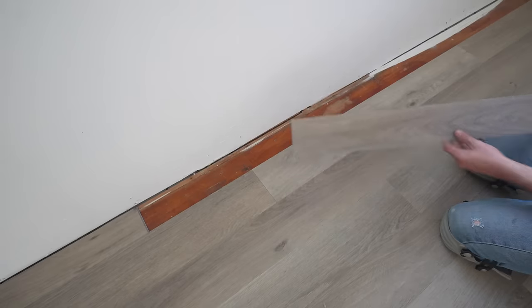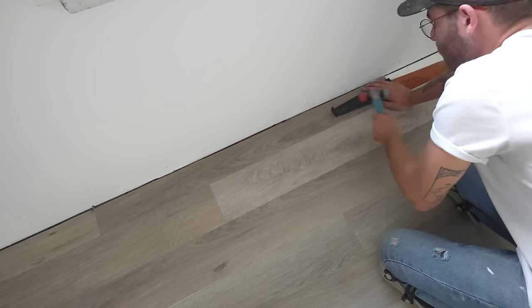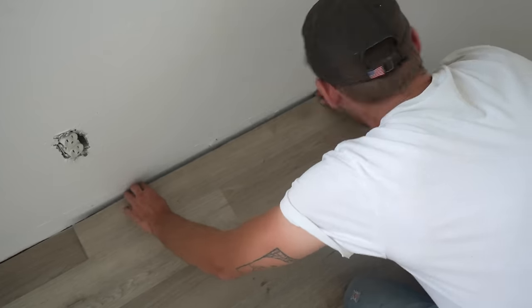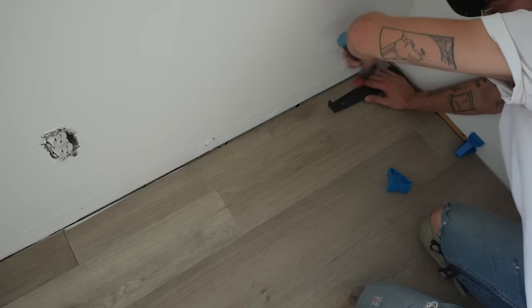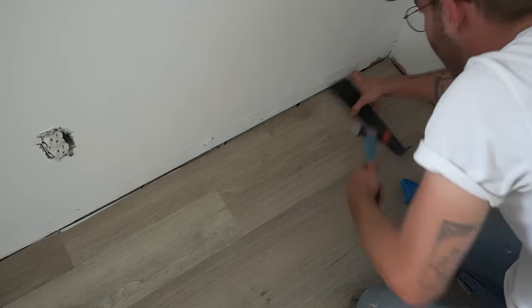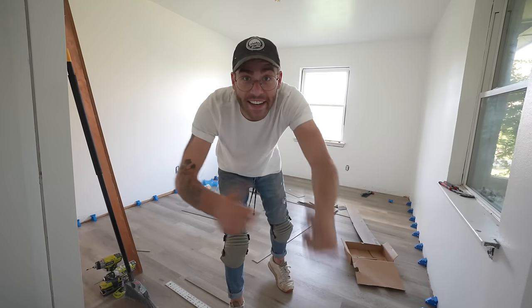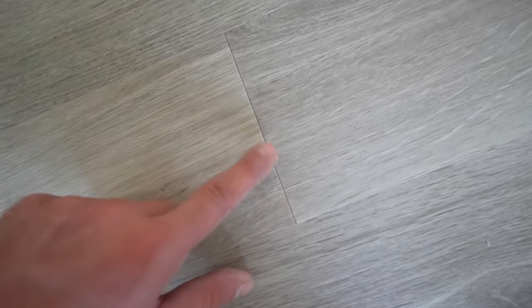The pull bar is critical here, making sure that the last row interlocks with the existing floors. I'll admit I'm a little embarrassed by my jigsaw cut on the last piece on the left side — it's a little more than I want — but the trim still has a quarter-inch of coverage. My cut got a little wonky and off the line, but it's still a half-inch gap off the wall and that's workable. And with that, we're done.